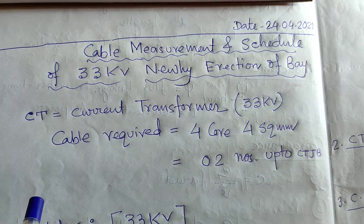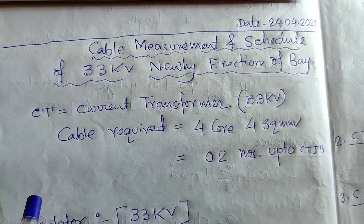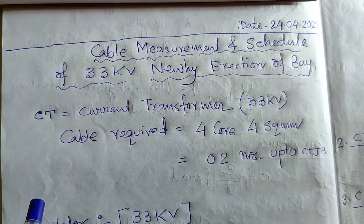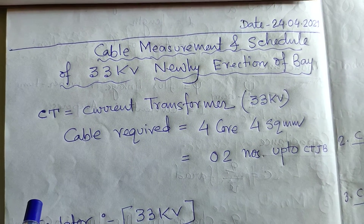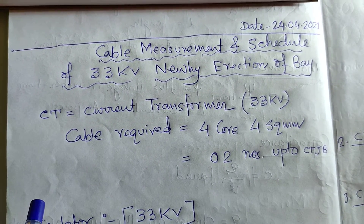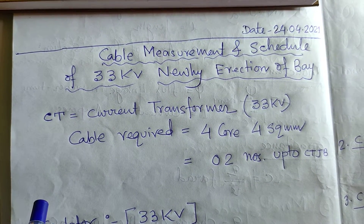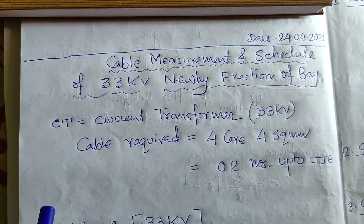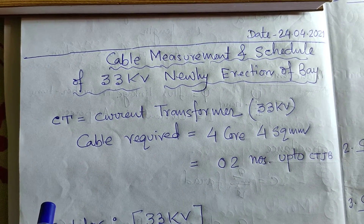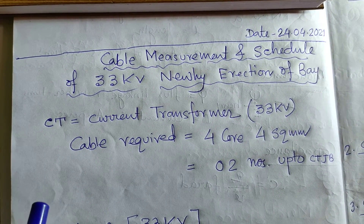You also have to arrange for flexible type and rigid type connectors, and also CT strap-to-pad, pad-to-pipe bus 1.5 inch pipe bus, IPS pipe bus to pad, to isolator, and pipe bus to moose connectors, etc.